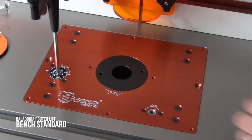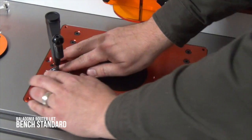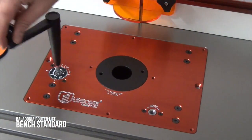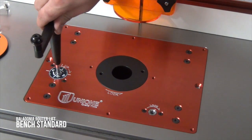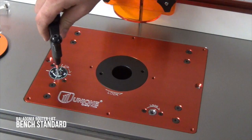The router lift has been designed for metric use. You can adjust the cursor to zero as necessary, then with each full revolution of the wrench, the lift will move by 2mm. This makes a quarter of a turn 0.5mm, an eighth of a turn 0.25mm, so every graduation you see is a very fine adjustment of 0.05mm.